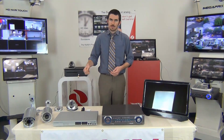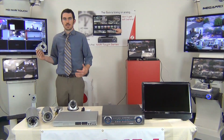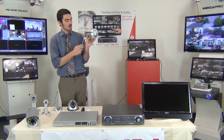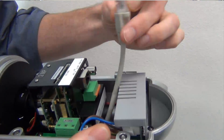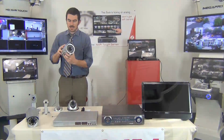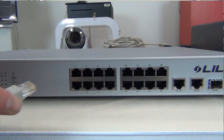Next we're going to go into the setup — what you actually plug in once you've installed your camera, where you're going to plug each wire. So you have put your mount on the wall and placed all of your cameras where they need to go. You're going to have a Phillips head screwdriver to open cameras that do have outside housing — just two screws to open. Once I take out those screws I can open the unit, and I'm going to take my CAT6 cable that I ran to the installation site, feed it through the bracket up into the camera, and plug it into the RJ45 connection. Once I plug that in, I am done on the camera side. I've run the CAT6 back to my head end location where the PoE switch is going to be located, so the CAT6 is actually going to come in and plug from this camera straight into port one.